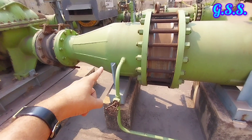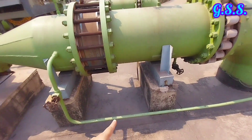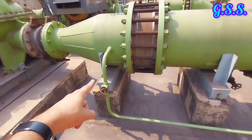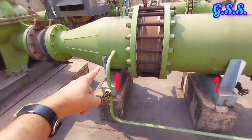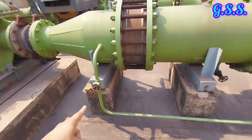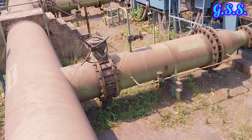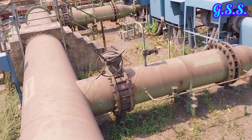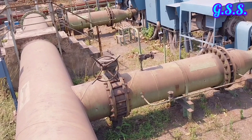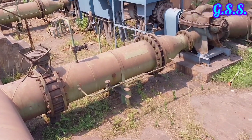For non-critical cooling water lines, the pipeline can rest directly over the steel member with guide angle, but a protection plate must be provided at pipe bottom with welding all around so that rainwater cannot ingress. This type of U-clamp or U-bolt type support can be provided for cooling water lines, but a protection plate must be provided to prevent corrosion at pipe bottom.